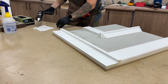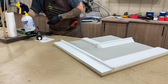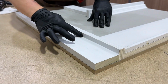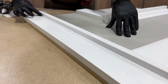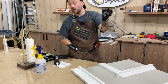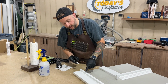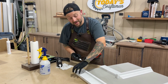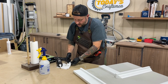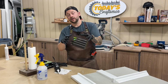All right, little spritz, wet our finger. You can see how much comes off. It's really a game of putting on and taking off most of it, but all of this that rolled over onto my finger, if this wasn't wet, it would be stuck all over both sides. And it's really hard to clean off, and to clean it off, you're gonna ruin this nice bead that you've already made, so you definitely wanna use water.